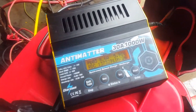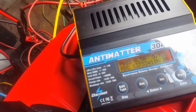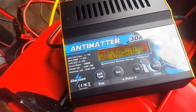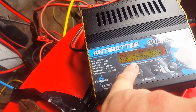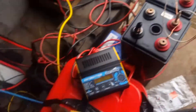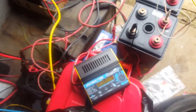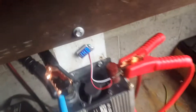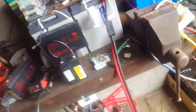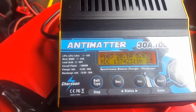So I left it to go overnight. I'm only discharging at 8.5 amps now. It's still got 5.9 volts in the pack at 137 ampere hours so far. I wonder why it was only discharging at 8 amps — the battery bank is completely full. I even turned the solar off last night. There we go, back up to 20 amps.